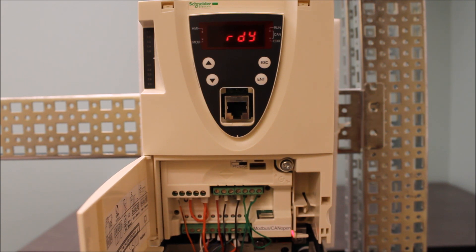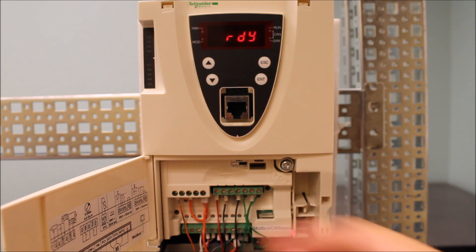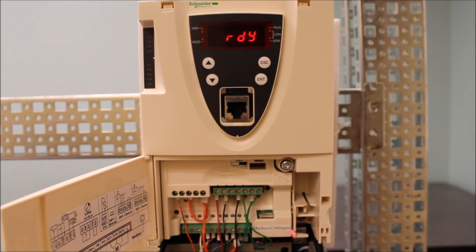At that point, what you want to do is measure both your 24-volt terminals right here and your 10-volt supply terminals right here — the leftmost right here and the 24-volt right here. You need to get a meter and measure 24-volt DC and the 10-volt supply DC as well, and see what you're getting from those points to common.